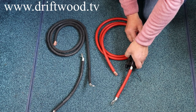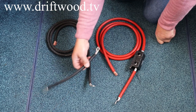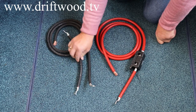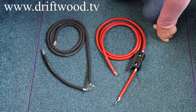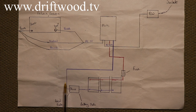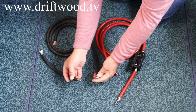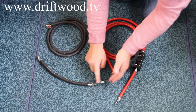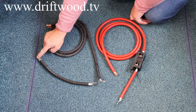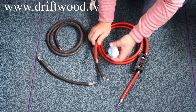Both of these cables are exactly the same length. The negative DC cable has a break in it — looking at the wiring diagram you can see clearly that the shunt will be fitted into that portion. So we're going to put the shunt between the two portions: one end goes to the inverter, the shunt goes in the middle, and then the other end goes to the negative side of our battery bank.